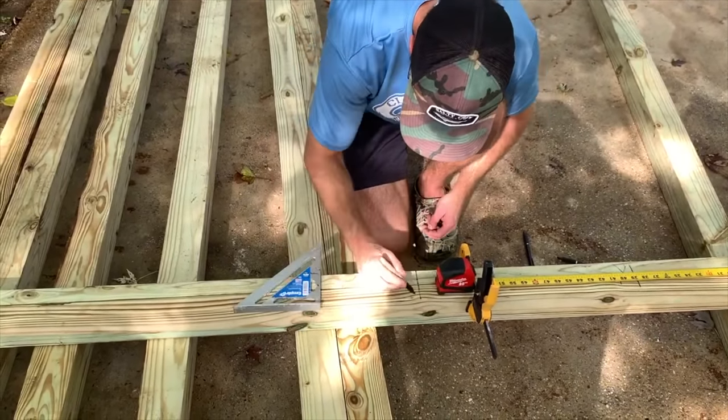We're going to be trimming the first shingle in each row according to the manufacturer's instructions and to make sure that we have a staggered joint. And then we're just going to install the shingles all the way across each row. As you can see, I have a broom up there on the roof so I can sweep off any dirt, debris, or leaves so I have a clean surface to install my shingles on.